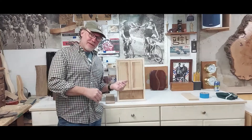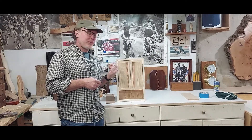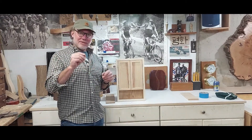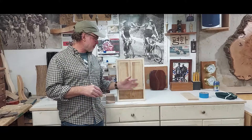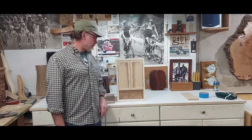I think it's going to fit just about right — and I hope so, because this took a long time. The installation of the hinges went — well, not snap, everything went in perfectly. It never does. I had to mess around with them a little bit to get the reveals right, but eventually I got it the way I want it. When you're doing these little cabinets with less expensive hinges, get hinges that have removable pins. You don't want to take those screws in and out too many times because the threads are so fine that they start to get a little wonky and they lose their purchase. So it's easier when you have to take them out to sand or whatever — just take the pins out. It's much better.